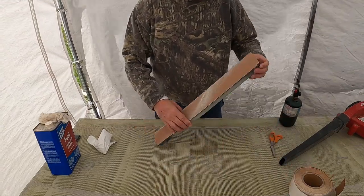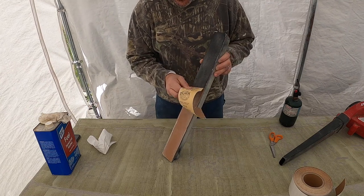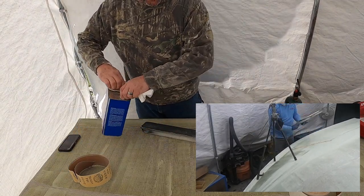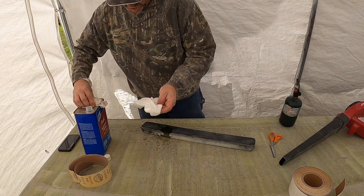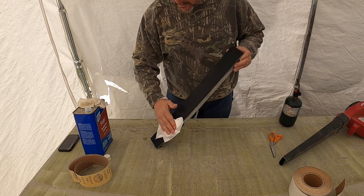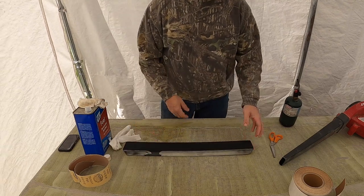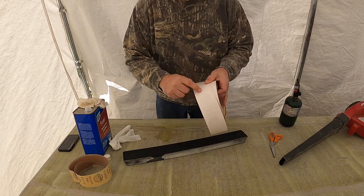This is something I learned about changing sandpaper on the sanding block. When you pull it off you get a little dust underneath there. In the last video, I'll show a clip where I put a new piece on. In trying to get all that dust off, I'll use some denatured alcohol - it's very windy today - and wipe all this off. I'm getting any residual glue off that was holding any dust or anything like that. As I wiped the surface, I thought I'd let that dry, then pulled out a new piece and stuck it on there, but it was flinging. What happened was the alcohol broke down the adhesion.